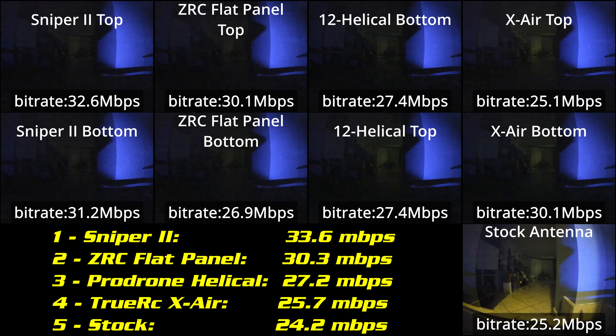My consideration is that if you check each recording for each antenna when connected to the bottom left connector versus the upper left connector, I cannot really find any significant or constant systematic change between those values. Sometimes it's best on the upper connector, sometimes on the lower. So this is not the kind of test to determine which connector position is best.